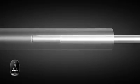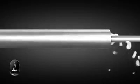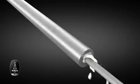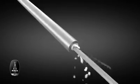To further enhance the accuracy, both the workpieces and cutting tools rotate in opposite directions, which effectively doubles the relative speed of rotation. And to keep the freshly cut internal surface pristine, we continuously flush out the waste material with high-pressure coolant. To keep up with demand for BSA rifles, our machine has 3 spindles, allowing us to process 3 workpieces at a time.